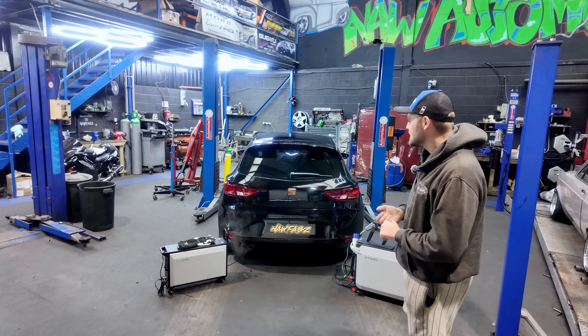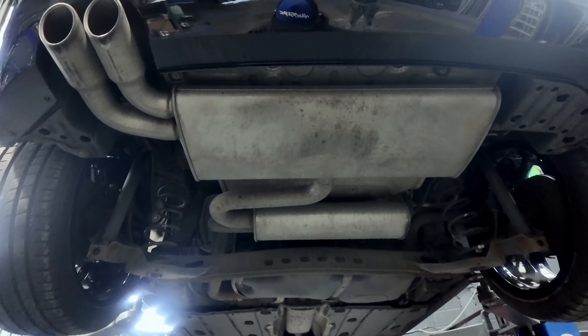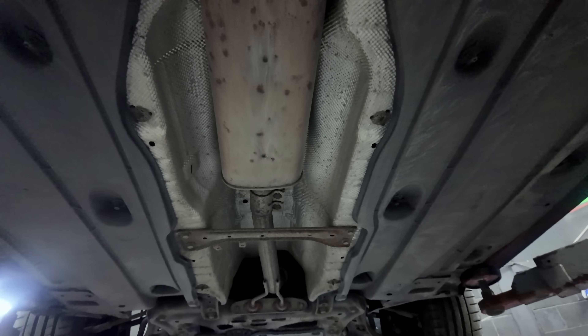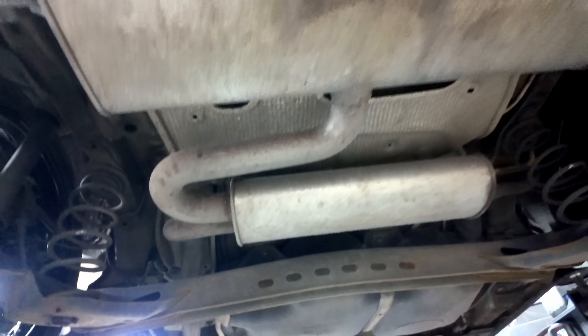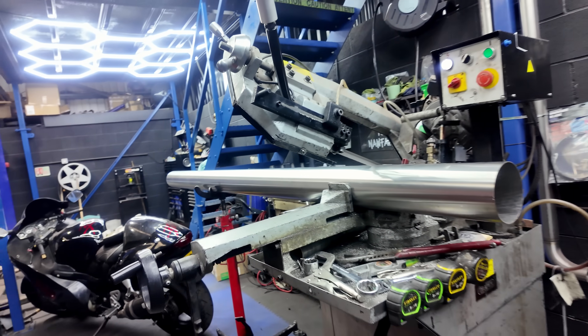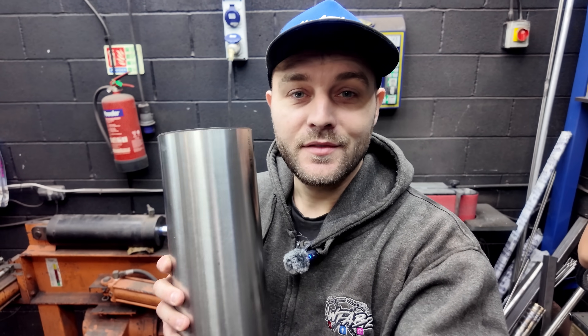As you can hear there's absolutely no exhaust sound from this car at all — literally nothing. Let's have a quick look at the exhaust system. This model has three massive silencers. We are doing a cat-back exhaust today — we're going to run most of it through the bender, do a silencer, and I'm going to weld the silencer with the laser welder. I'm going to bend up one over the axle, no back boxes at all, to an Akrapovic carbon fibre tip — this thing will sound wicked. We build everything in house. The silencers start as a long piece of tube — we cut off the sides we want, push in the end cap, and normally I TIG round this. But today I'm going to use the laser welder to fuse round the top, so I'm going to rig up a little test piece before I go straight for the Mona Lisa.